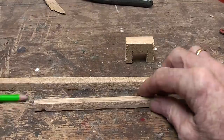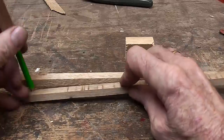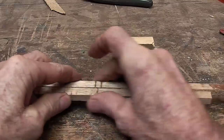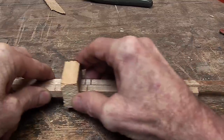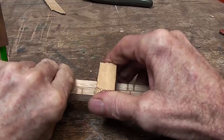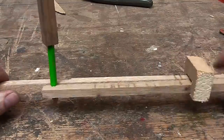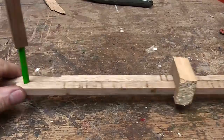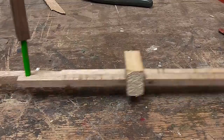Right, to use it you're going to basically take the two sticks and put them together, put your pencil into the slot there, and then down further you're going to get your clampy thing, put it on, and then slide it up. While it's looser, you can let off the tension by pulling it back down a bit, and then you can measure, adjust that, get it to the right distance you need it, and then push it up to clamp it shut, and now you're ready to go.